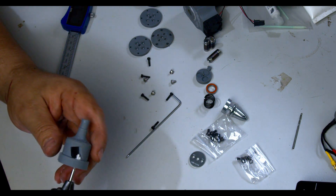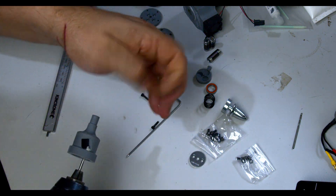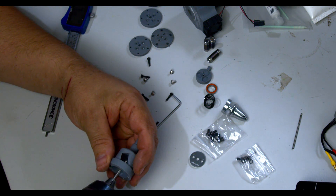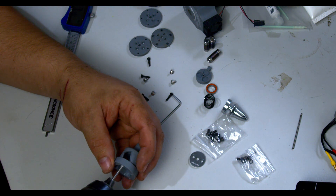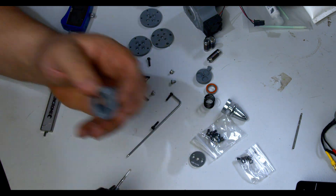You can see the amount of material that comes out — that's all getting pushed down to the end normally. That's why you've got to be exceptionally careful when you're going into blind holes, because that material itself will cause the hole to blow out, or in the case of metal, it will cause the tap to snap.